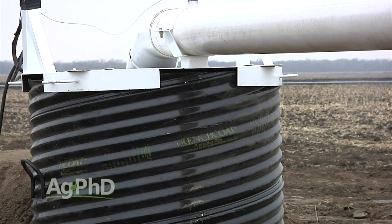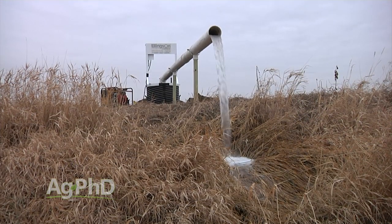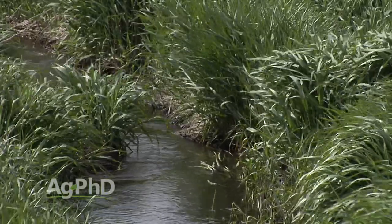When the water gets to this tank — kind of like your sump area in your house — and the water has to get out, you can use a lift station to get it out of there. Why may somebody use a lift station? Why don't you just let it run out the end of the tube and out of the field? Well, it depends on where you're going. In some areas there are drainage ditches that are dug. Everybody can drain into the same spot, that can run right into a stream or river, it's easy to monitor, easy to shut off, and to get over into those drainage channels sometimes you need a lift station.